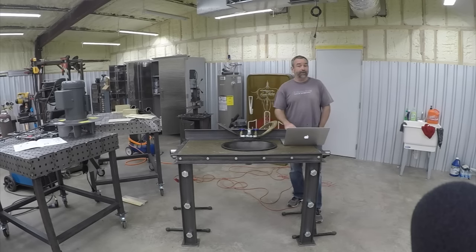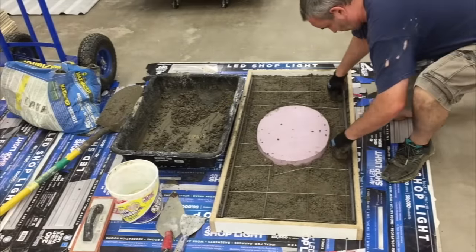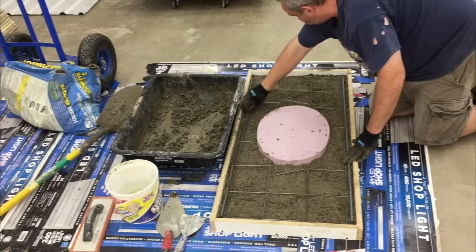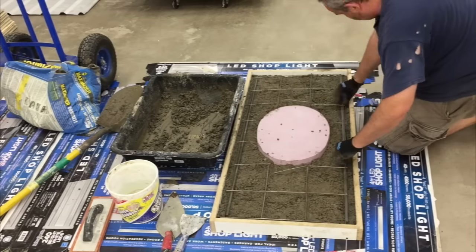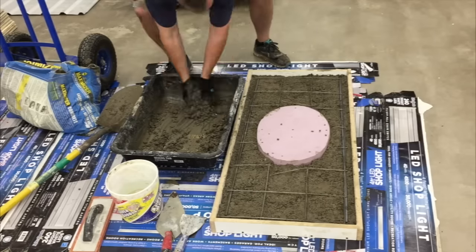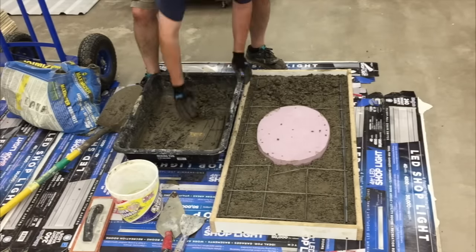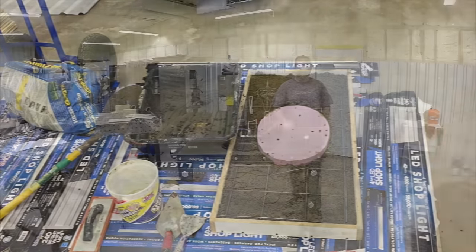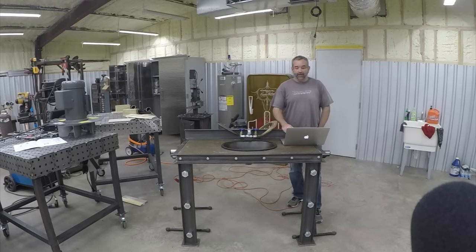At the time, as you're seeing this, I didn't realize what was happening. I went ahead and put the first layer in, and then in the middle I put the mesh in. I used two 3/8-inch rebar rods in the front and the back where the thin areas of the countertop are to give it some extra strength there. When I pulled it out of the mold — which is the footage I lost — I was really bummed to see it was really porous. You could see all the aggregate, it was rough, there were voids in it, and it was really rough looking. So I was ready to ditch it.